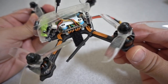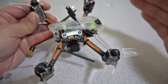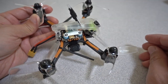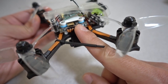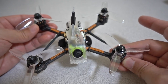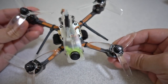I'm going to put that theory to the test. I didn't realize this at the time I flew it — that's the voiceover. I've been noticing that all of the GTR series designs seem to be having this tuning issue. This was no different, so obviously it's going to require a retune. I'm probably going to go straight to Betaflight 4.0, loosen up the screws so the stack can move freely and the vibration dampening is more effective, and then come up with my own tune. If you want to see that, leave comments below — if there's enough interest I'll make a follow-up video. Otherwise I'll move on to things that interest a larger audience.